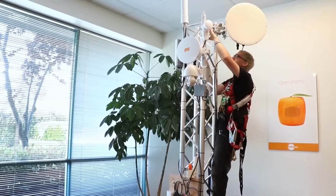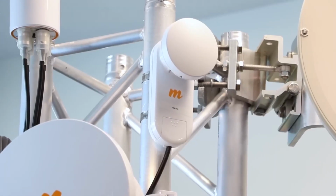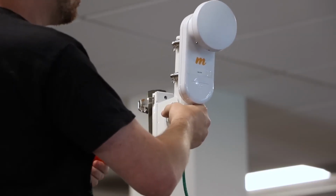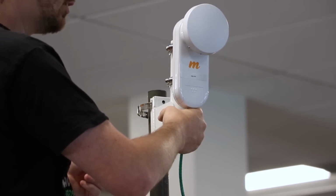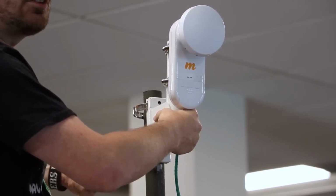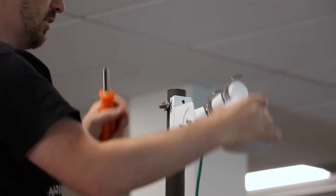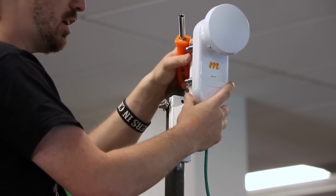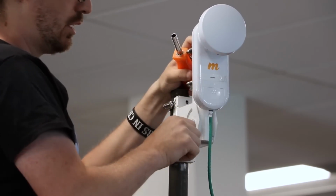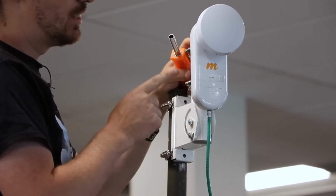This C5X has been mounted with the hose clamps, and it's going over to this location right across the room here. Here's the Flexi Mount and the C5X we put together earlier. So we're just mounting this to a pretend rooftop, non-penetrating roof mount. Now that the mount's secure, we can aim this in the right direction, which is right over there. And then you would tighten down the nut on here with the 10mm wrench. Then you're good to go.